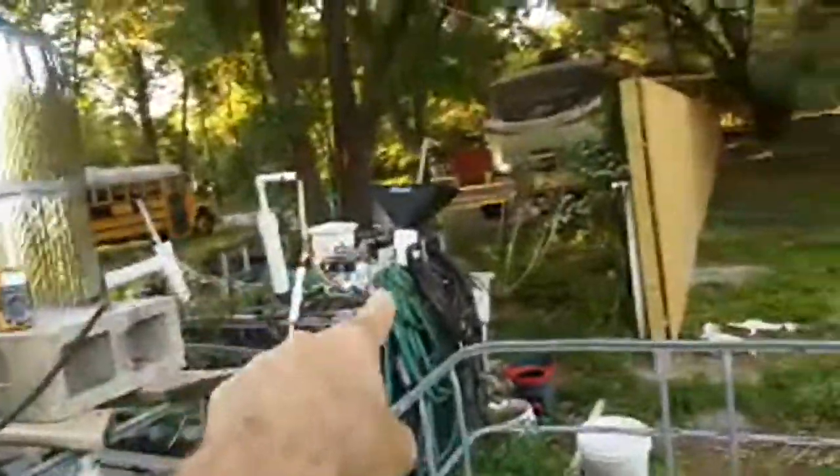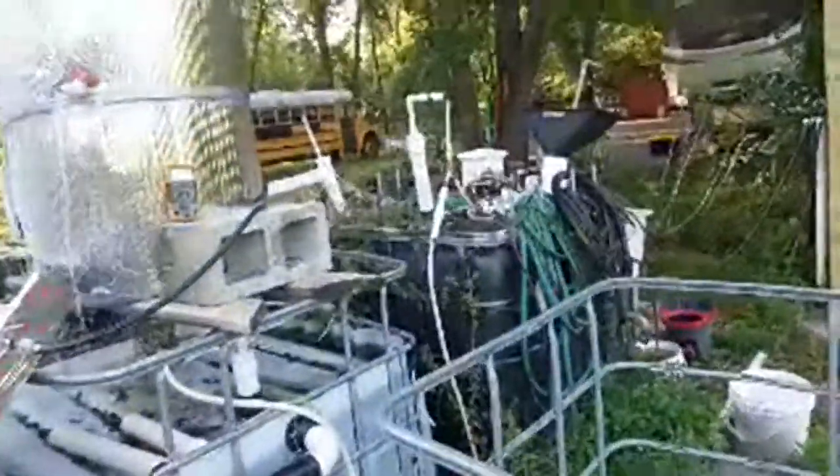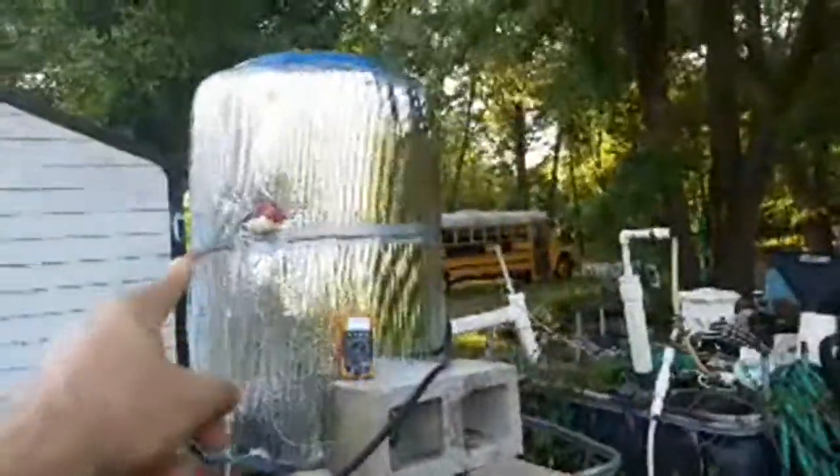And I like using the IBC Tank biodigester as the stand for all of this, because you're doubling. You're getting solar hot water and biodigester. Now this is the gas holder. That's the actual digester. We could have put it on top of the digester and we could be running hot water in the feed pipe of the biodigester to help improve gas production. But the geometry of it now, the way we have it set, there's no room for it. But I think I'm going to run a pipe, actually a T, so that I can get hot water in the digester as well as into the shed for the laundry.